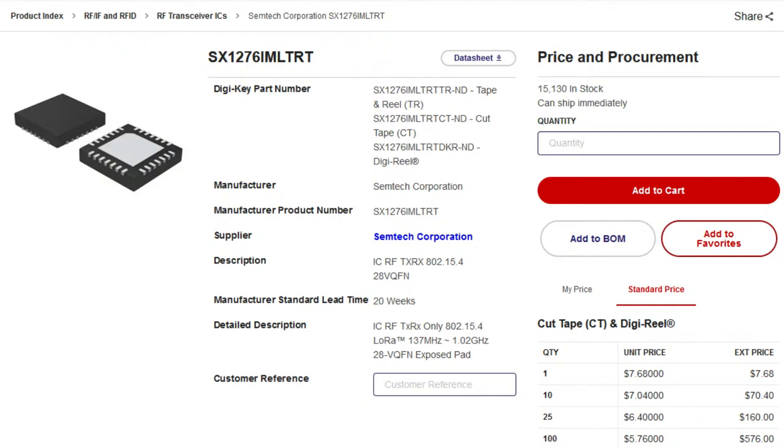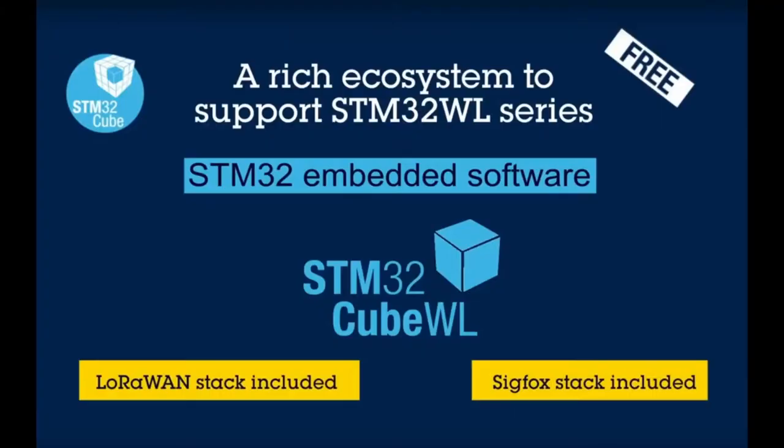It's like five, six bucks. And you actually kind of have to use this radio if you're using LoRa because it's under patent. What's cool about this chip is it has that radio literally inside it — you don't need to wire it up. And you even get the Sigfox and LoRaWAN stack. Sigfox is a paid network that's similar to LoRaWAN. If you're interested in Sigfox, they run the backbone network for you, so you don't have to have a gateway.